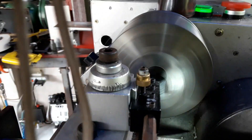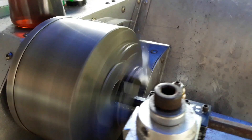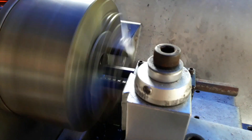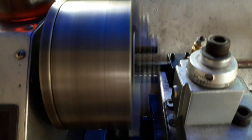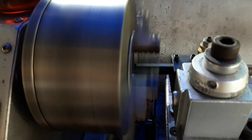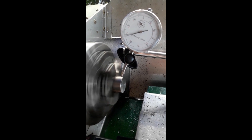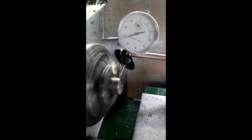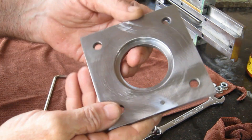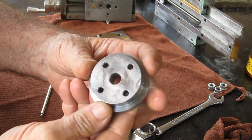It did a pretty good job actually, and I was surprised just how much of the slack I managed to get out of it. It's pretty good now, and any little runout that's left you can get out of it just with a bit of a tappity-tap-tap. As you can see, at three hundredths of a millimeter — which is only a little over one thousandth of an inch — which is nothing. Pretty happy with that. I spent a long time assembling all of this and getting it just right, so I've just partially disassembled it and thought I'd show you how it all goes together.